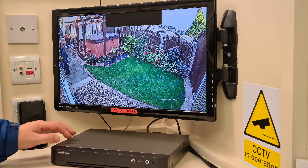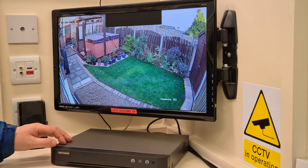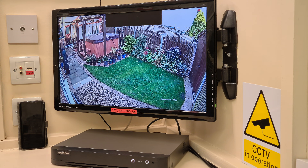This has one big fundamental difference to the previous model, and that is that the human and vehicle recognition can now also be used on motion detection mode, which is a massive leap forward. I'm quite impressed. So if you want to go back and have a look at the video for the second generation AccuSense DVR, please do, and it might also be handy to go back and have a look at the motion detection setup on Hikvision DVRs in general. We've done videos on that too.